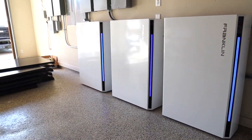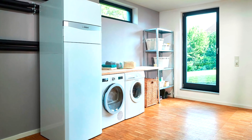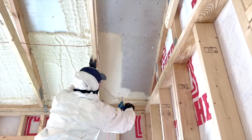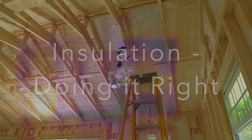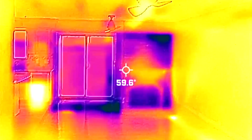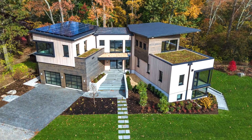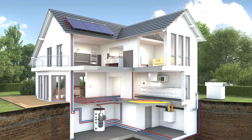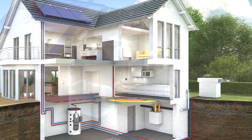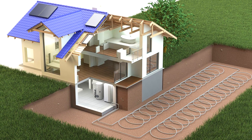Batteries — meaning chemical batteries, typically lithium ion — a water tank, thus heat thermal storage, outstanding insulation, and finally the grid backup for power generation. To power heat pump systems, most of the energy is actually transferred either from the outside air or the ground to the home. The remaining electricity to do so can be provided by solar, with or without local battery storage.